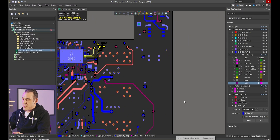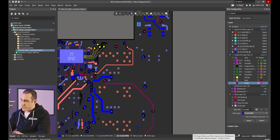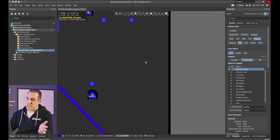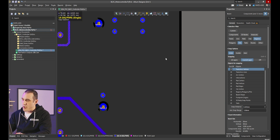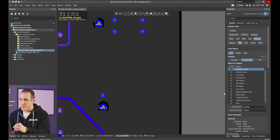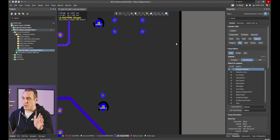Here I have one of the designs submitted for our design review series pulled up, and I'm going to apply some of these objects in the PCB layout and look at the various options for applying the solder mask opening on these copper pours. If you're unfamiliar with all the different tools in Altium Designer, there are three different tools you can use to draw out large copper pours, and how you apply the solder mask opening really varies depending on the object you use. So first let's look at fills and regions.